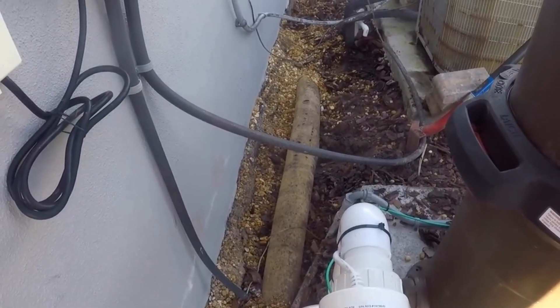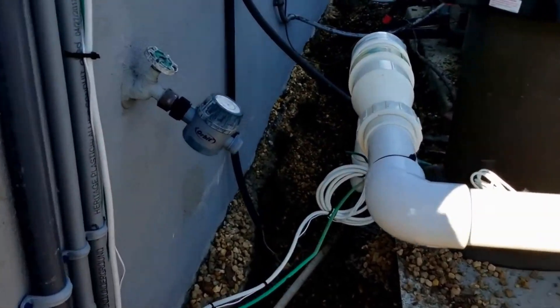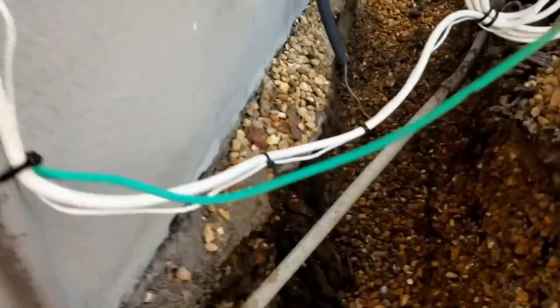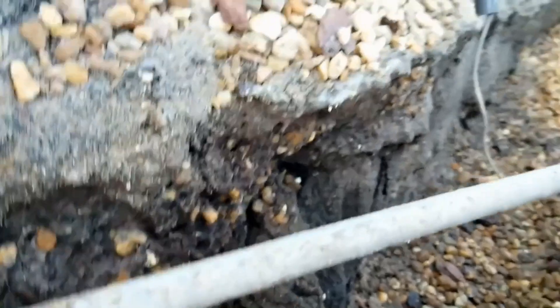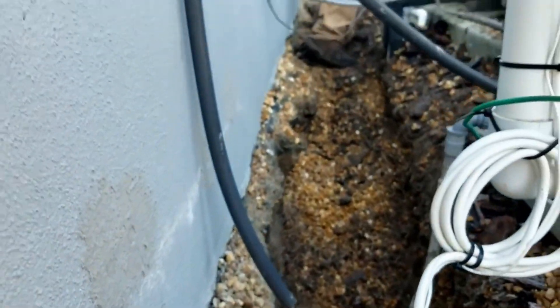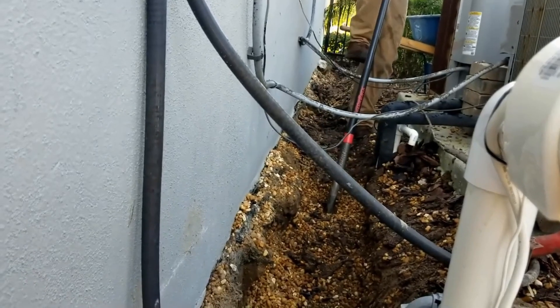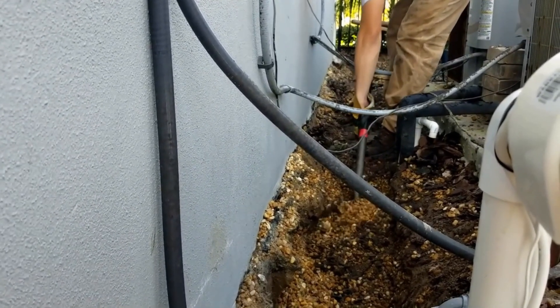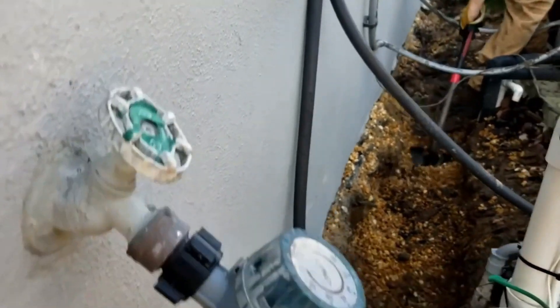It just poured into the house in that corner and caused all kinds of problems. We're going to have to dig this up and replace it. We're going to use EasyFlow — it works so good in the sand. Chuck's making quick work of getting rid of this extra stone. We have to take the stone out because it's not deep enough; we want to get our footer system a little deeper. We did find a piece of something they'd left under the floor — water's definitely been traveling along that. Notice how clean the gravel is — this system was not wrapped, and there's no debris in that gravel at all. This is pea gravel. One of the reasons we use EasyFlow is because it has a 30% better flow rate than gravel, and it's a self-contained system — it's already wrapped.